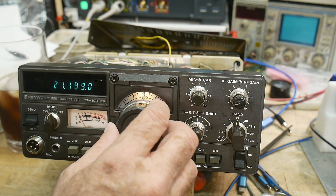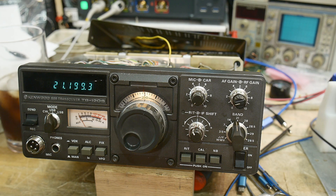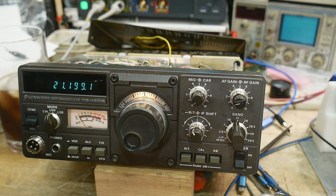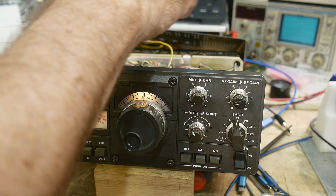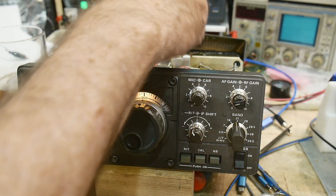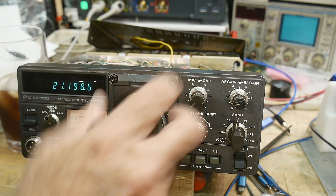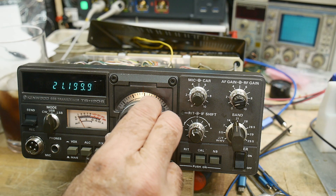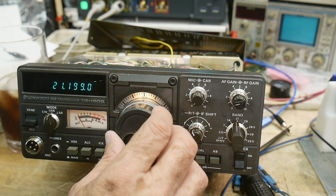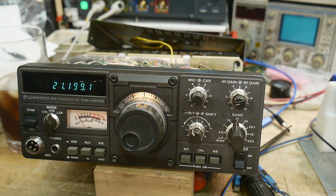This is the tone we're injecting. That's interesting — wonder what that motor-boating was. It goes away; there's still something wrong with the machine here. Maybe there's a capacitor inside the VFO that needs to be replaced. We might have to open up the VCO can — let's take a look at that schematic.